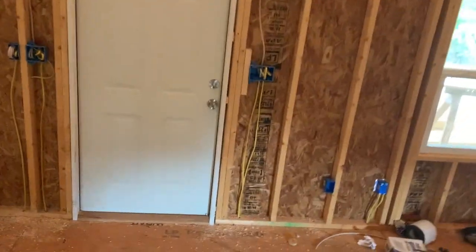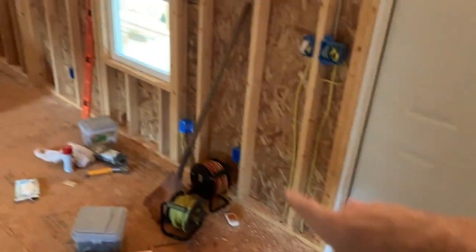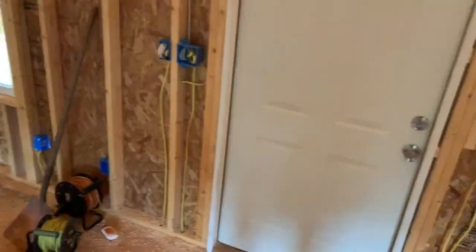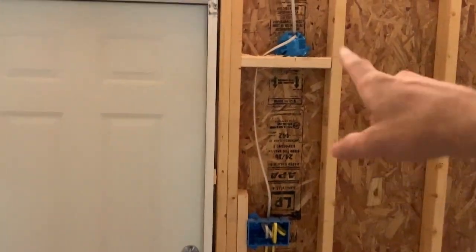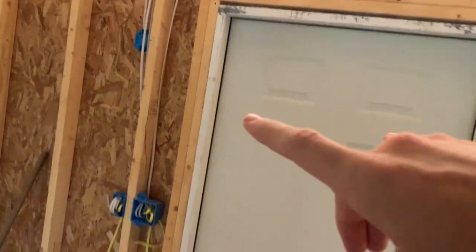And we also did the porch, which y'all saw. So we did the outside, the porch plugs and lights all on one. We started down there and jumped to each one, to the switch, plug, whatever, and then run switch to that light, and then jump to that one over to the door lights for that one.